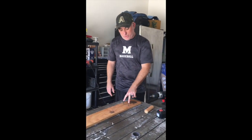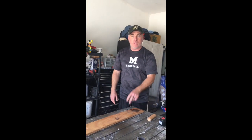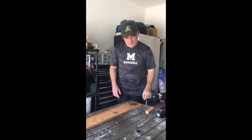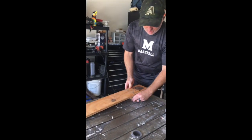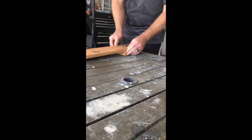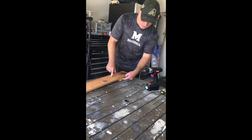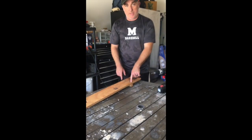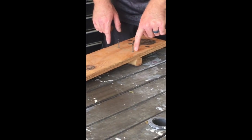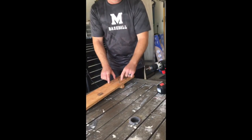I have our two wood screws already drilled a little bit into the board — I drilled pilot holes with the drill bit. Your dowel is now going to go underneath your board just like that, and we're going to drill the plywood into the dowel. The dowel is about seven inches up from the end, so make sure you mark that. If you look here, I have a little green line where I marked seven inches, and now we're going to drill and connect the dowel to the board.